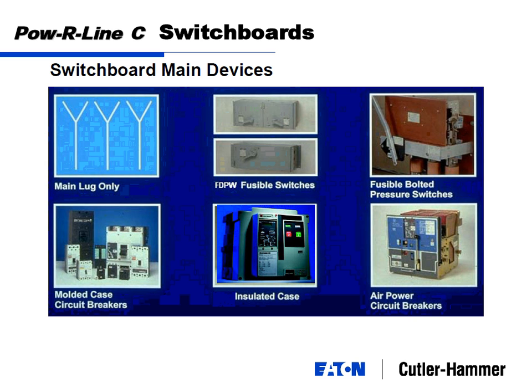Rather than be that size, I'd say you're probably talking 80 to 100 pounds, and you're maybe this tall and this wide. Air power circuit breakers are 100% maintainable. You basically rip them down, open them up, down to the spring, to the washer, to everything on the inside. They have a two-step stored energy mechanism on the inside, like a spring and a motor. So you can open and close them electronically. In other words, you can go back to your DCS system, to a push button on the other side of this wall, and open and close your main device without ever having to be at it. And that's the beauty of these air power circuit breakers.